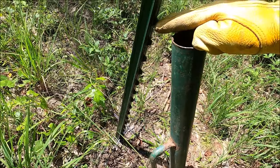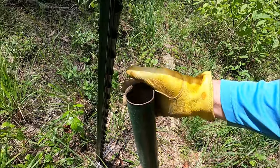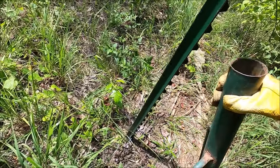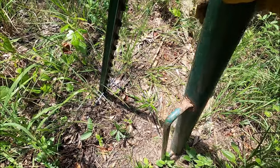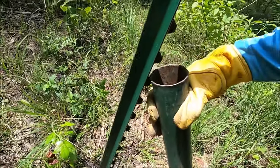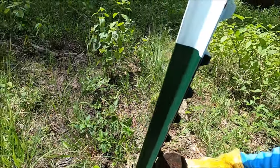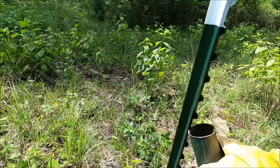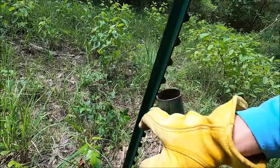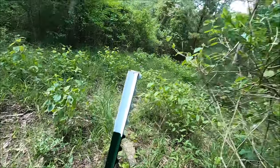The next step is to get one of these teeth lipped over the edge of the opening in what's now the top of the t-post remover. In order to get it latched on there, what I like to do is position the bottom just far enough away that when I lean the driver forward it's laying on top of one of those teeth. Then I'll push the t-post forward, which is going to allow the opening of the driver to fall below the tooth — that's going to catch it and give me the leverage to remove the post.